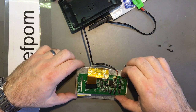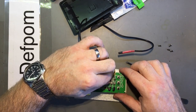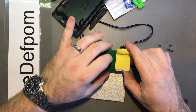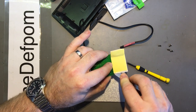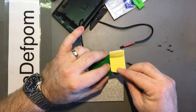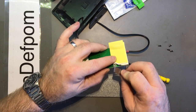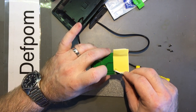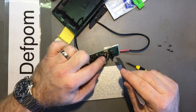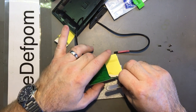Where do I start? Power, I'm guessing. There's a four-pin connector with three wires. Yellow is often used for video, so that means red and black are truly red and black. The black wire is going to the third pin from the left, which has ties to the ground plane - so that's correct. This unit can actually support dual inputs, but there's only a single camera input on here; if you add another wire it could inject another video source.